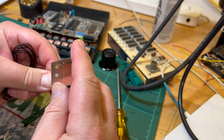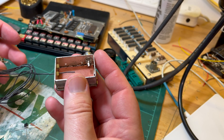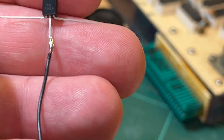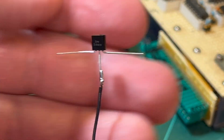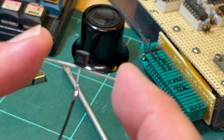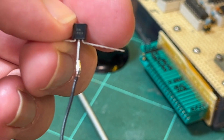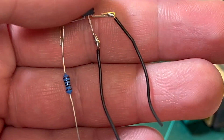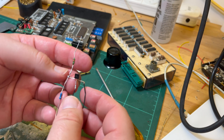I'll run some wires in - you can run wire in for ground as well, or just use the chassis. Run nice thin wire in: one for signal, one for five volts. I've got my transistor ready to go. The base takes the video signal from pin 16 of the ULA, this one just needs five volts, and then we do the biasing: 100 ohms to ground, and then 18 or 33 ohms depending on brightness - I normally use 33 ohms. So five volts, video signal on pin 16, ground, and then video output.